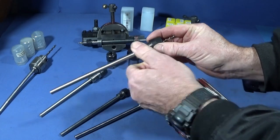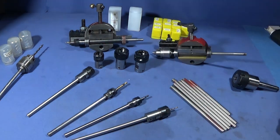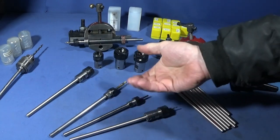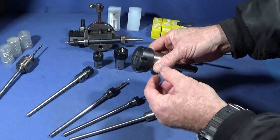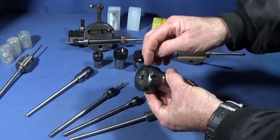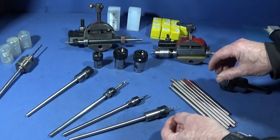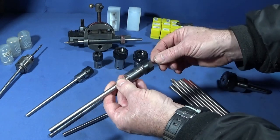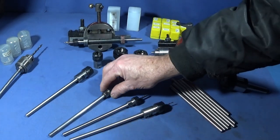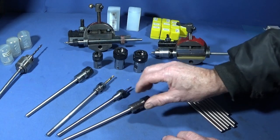You can actually hold on the 8mm bar or on the outer diameter, so you could use the drills in the chuck. I find it an excellent system having all my favourite tools set up — I can quickly pick them up, and it's much quicker to load them into the ER32 for the tailstock rather than having to swap out a collet each time. I've saved my favourite tools as I've gone until I've got them all set up, and I'm even going to make a rack for these so I can quickly pick them up when I need them.